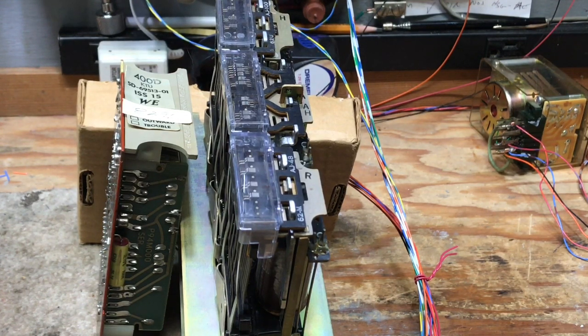The 400 KTU was the next generation of advancements in the 1A key equipment, or actually 1A1, 1A2. It was designed to be modular, so you could change out the cards if there was an issue without having to rewire anything. As where if the wire spring KTU had issues, then of course it either needed to be repaired or replaced, or if there was another circuit not in use, then you would simply move the wiring to that circuit.